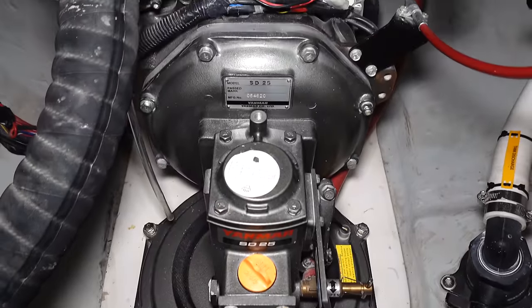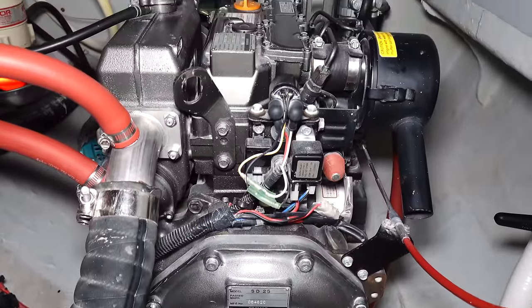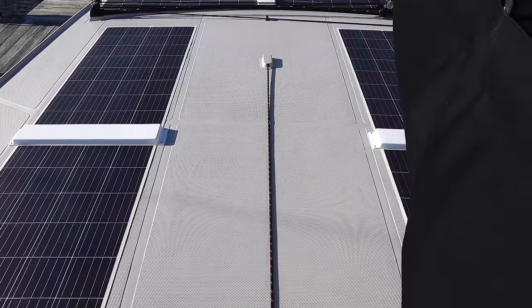On this boat, we do not have that Honda generator. We're probably not ever going to have that Honda generator. However, both our engines have a high output alternator in addition to their regular alternator. The high output alternators on each engine are 120 amps each. We also have a much bigger lithium battery bank than we've ever had before, and more solar power than we've ever had before. So we basically don't have any need for an external gasoline generator. And it is nice to not have to carry that extra weight and have another thing on board.